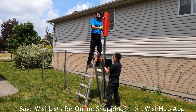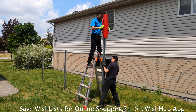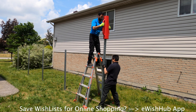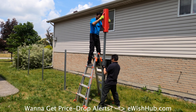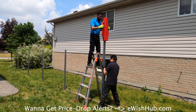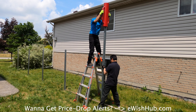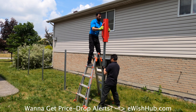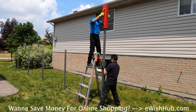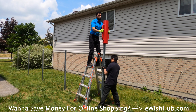The following will show you how to set a postmaster. Using the post driver, it can be pounded 4 feet underground. The depth of the postmaster needs to be lower than the frost line in your area. In my area, the frost line is around 38 inches, so I need to pound the post by at least 38 inches. Here is a demonstration of how to drive the post 42 inches into the ground with a manual post driver.